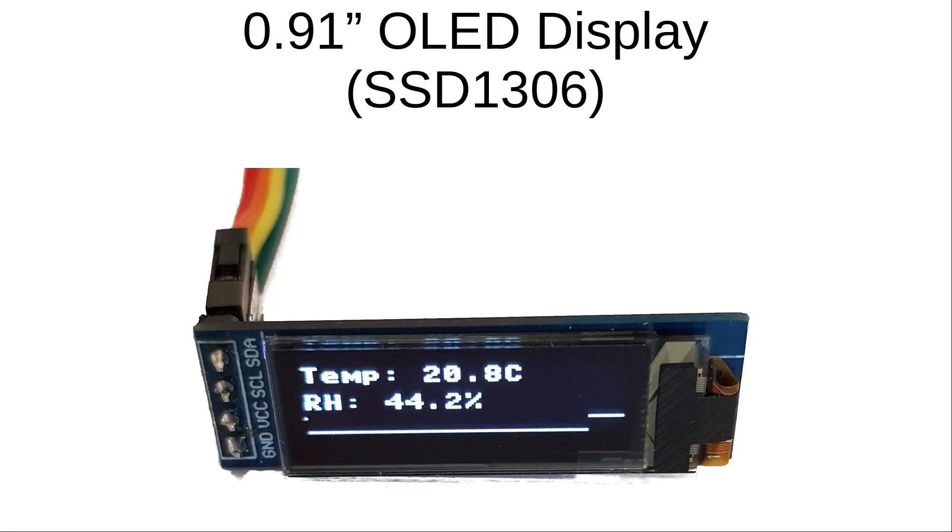To display the temperature I'll be using a tiny 0.91 inch OLED screen. This is a tiny monochrome screen with an easy to read display which can show text or monochrome graphics, with a resolution of 128 by 32 pixels. I actually bought this to create a departure sign for a model railway but I thought it would make a good fit for this circuit as well. These are available mounted on different boards — this version is on a very thin PCB with the I2C connector pins at one side, but other suppliers have these mounted on boards with connectors underneath and possibly mounting holes.